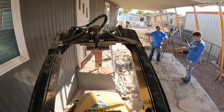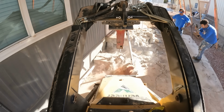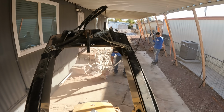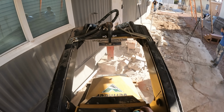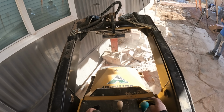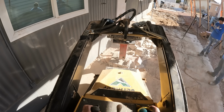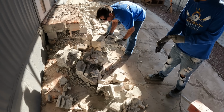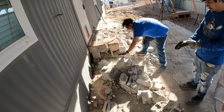So the way I attack this porch is like I would attack any concrete porch, with the idea that maybe they have an infill, like dirt or something in the middle to displace the extra concrete. So I went around about 6 inches from the edges, and that seemed to work. And we found that the edges were concrete, the infill was block, and the cores of the block on the infill were filled with gravel. Also, I found some wonder board in there. Just about everything that was laying around the yard went into this hole before they poured the concrete.